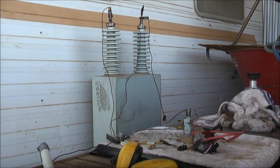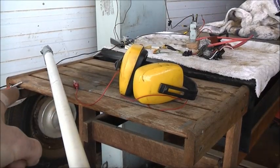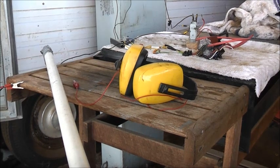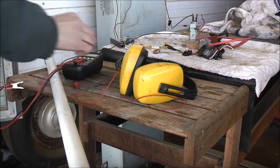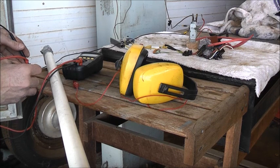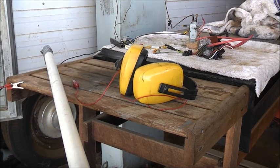I'm only going to get my multimeter and measure the voltage drop from the battery bank to that point there. I bet it's not quite 36 volts. Normally a capacitor like this will charge full in next to no time. Check the voltage here - 34 volts. I've got 2 volts of drop. My batteries are a bit weak too - I've been giving them a hard time on the ZVS the last couple of days, so the driver's probably not quite getting the current it should be.